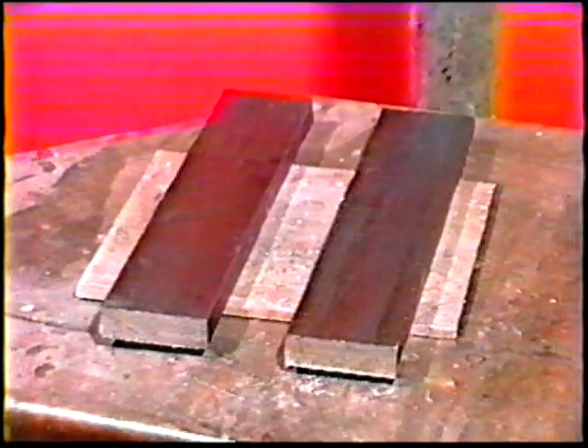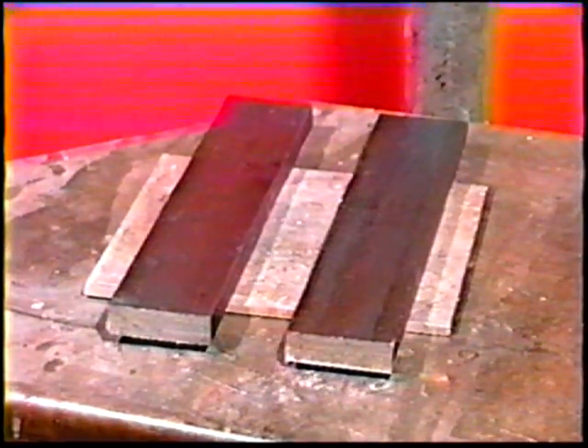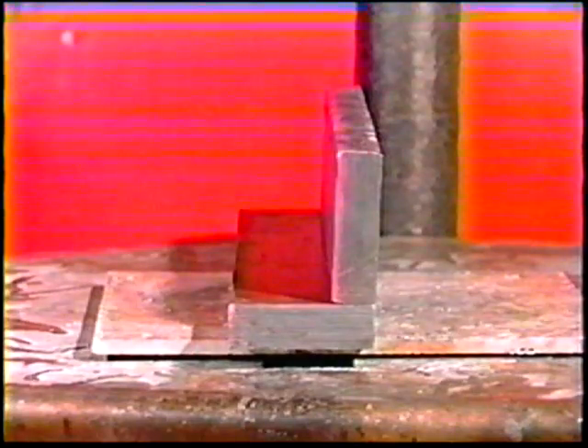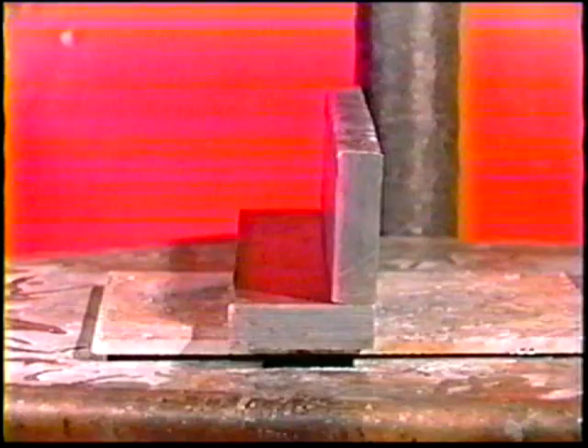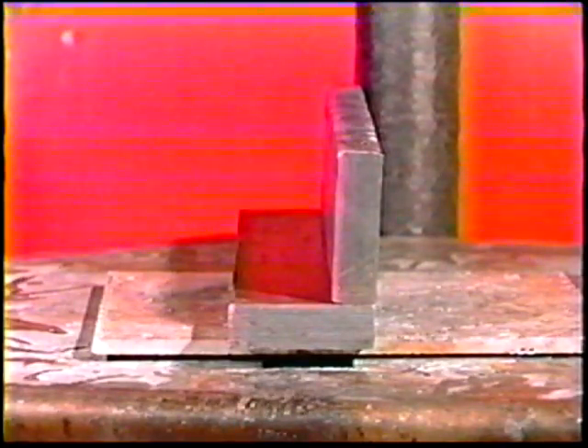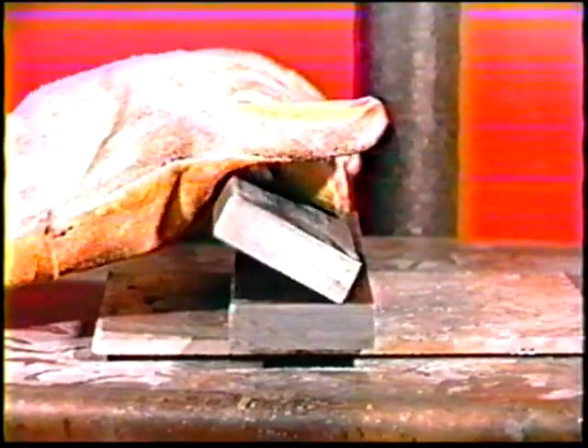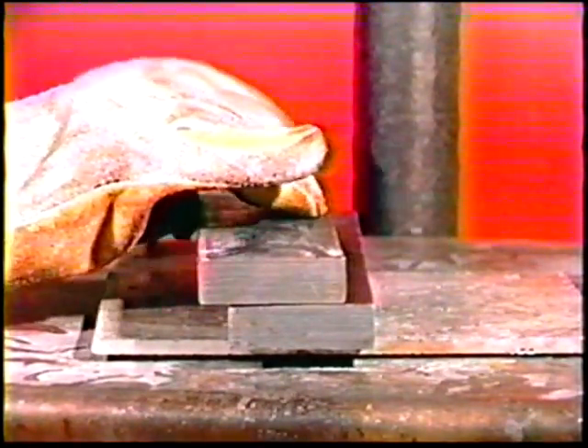The workpiece for this job practice is formed from two pieces of one-inch bar stock. Position one of the bars vertical to the edge of the horizontal bar. Then, carefully lay the bar down to form a lap joint which can contain a one-inch fillet weld.